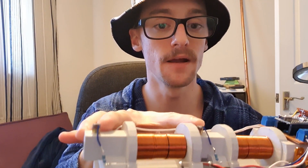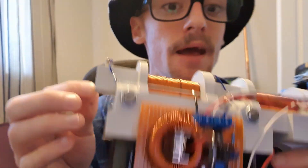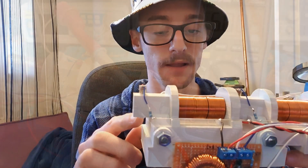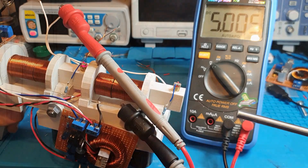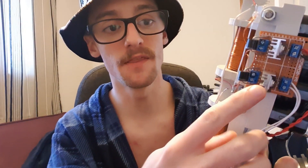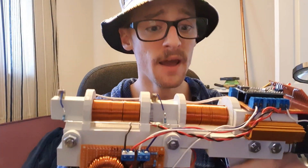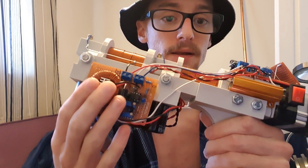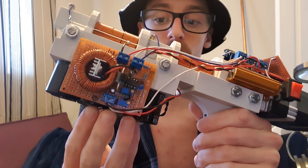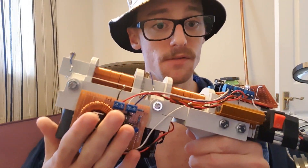You have to time these. These are two laser diodes that accomplish that — they shine on photodiodes here on the bottom. The photodiode can detect when the laser beam is broken, meaning that the projectile is there. This Arduino controls that; it indicates to these MOSFETs when they need to activate their coil. The Arduino does a couple of other things as well — it controls the boost converter circuit and can monitor the voltage of the capacitor bank and turn the boost converter on and off as necessary.